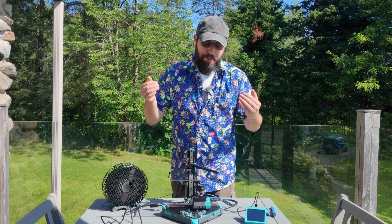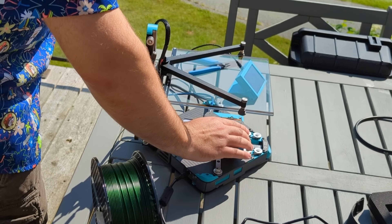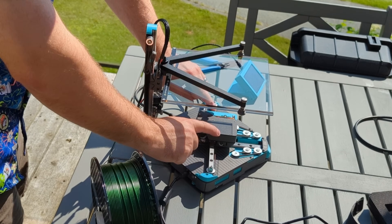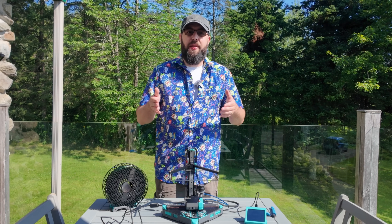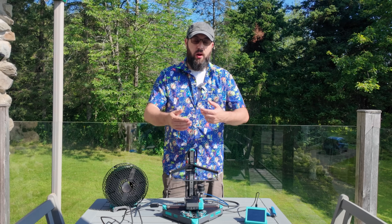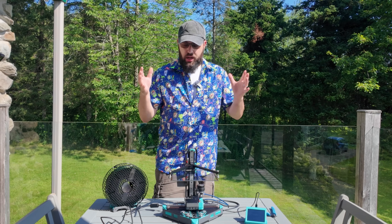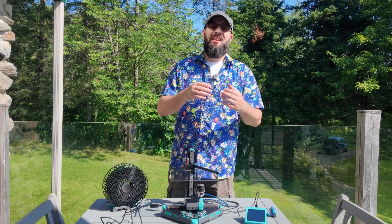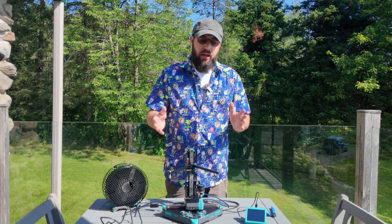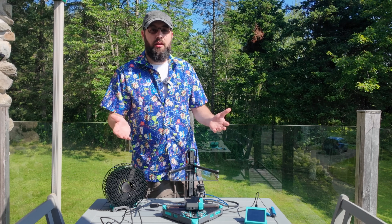This is an upside-down HBOT design. It's not CoreXY — while it may look like CoreXY at first glance, it's a modified HBOT. It's actually one continuous belt for the entire path — a really cool belt system. You may be wondering why the motion system is on the bottom and the bed is up top. That's because this printer folds. Think about it: with CoreXY or HBOT, you have to tension your belt and de-rack it. If you had to collapse your motion system for XY every time you took this printer apart and reset it, that would add a lot of complexity. So by keeping the entire XY motion system fully assembled, it makes tuning and calibrating a lot easier because it remains consistent through teardown and setup.